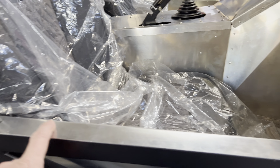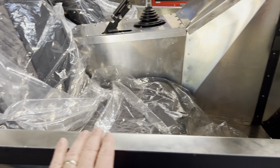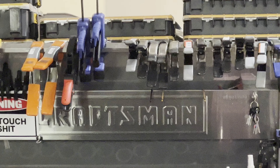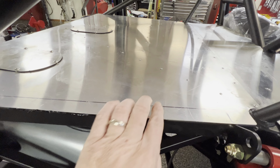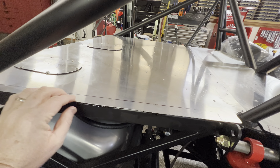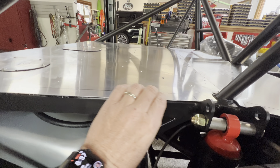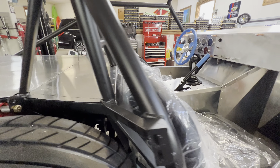You'll notice right here I've got no rivets, even though these panels are installed in silicone, and that's because the body's going to go in here and then some screws. The places where a joint is going to be lapped with another joint, I don't put the rivets in — I do clamp it because there is silicone in there. I don't want a double row of rivets. There's going to be another panel that sits here after the body goes in, and then they're riveted down. I clamped it so there's a little layer of silicone there, nice and snug without the rivets.